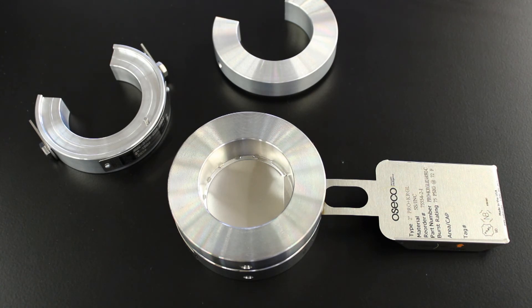In addition to the ProPlus and ProPlus KRGL, the PRDI is designed for use with the PCR and PLR rupture discs. The PRDI is available with extended heights for fixed piping applications or safety relief valve protection. Standard materials of construction are 316 stainless steel and carbon steel, but other materials are available upon request. The PRDI is designed to meet ASME Section 8 standards.